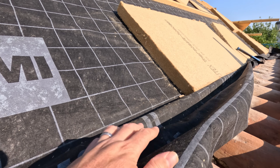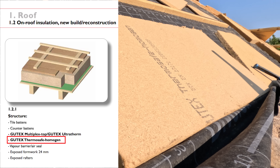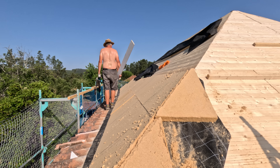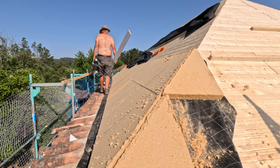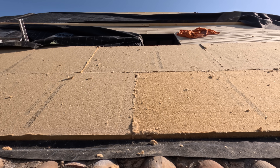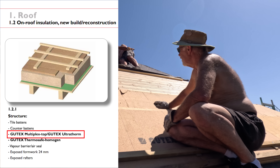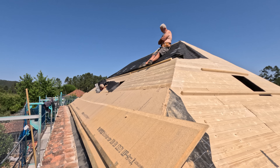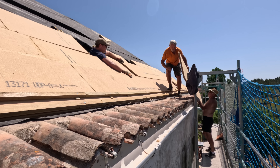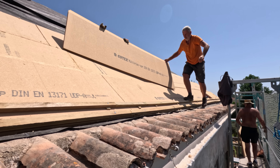This is a moisture permeable membrane. Next up we've got the first layer of insulation — the Gutex ThermoSafe Homogen, which is 60mm thick. It's a square edged rigid board of compressed wood fibre. These all slot together nicely with a little bit of overlap so you don't have joints running straight up and down the roof. On top of that we've got the second layer of Gutex — the Multiplex Top, which is 35mm thick and is a tongue and groove sarking board that is waterproof. Gutex say this layer can be exposed to the elements including rain for up to 12 weeks uncovered without any detrimental effects.